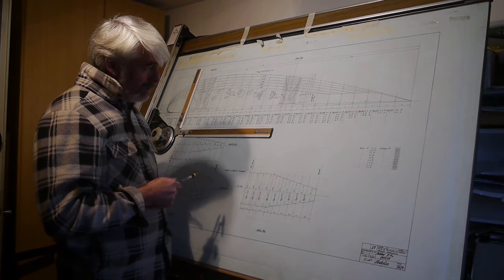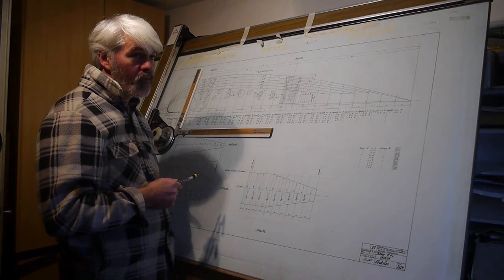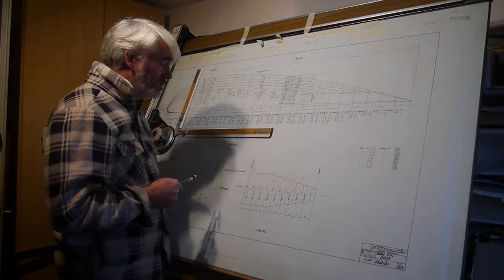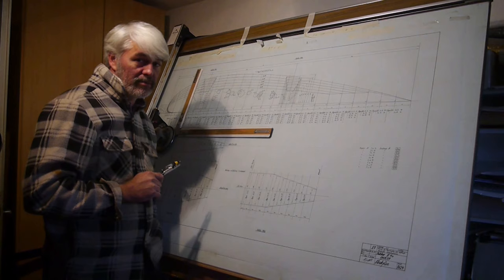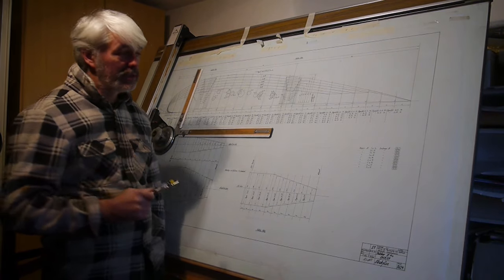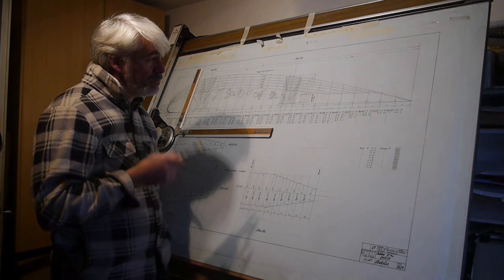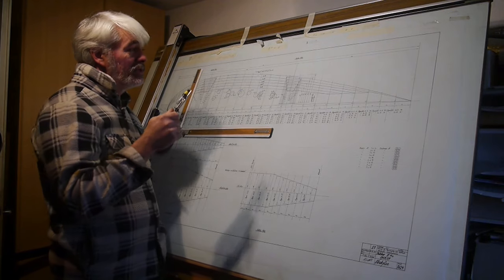The airfoil of the Fokker V40 is actually based on the lower wing airfoil of the Fokker D7. At least there is strong evidence that leads to this assumption. While creating the drawings, we also need a trajectory plan that determines the wing rib airfoil sections in between the very center rib and the outer rib. This is required because the airfoil tapers towards the tip of the wing. This has to do with the aerodynamic thinking that went into the wing — Fokker was way ahead of his time when he designed those wings.